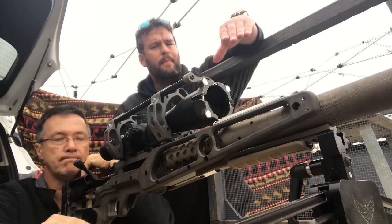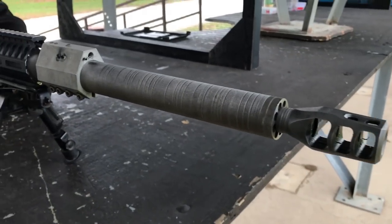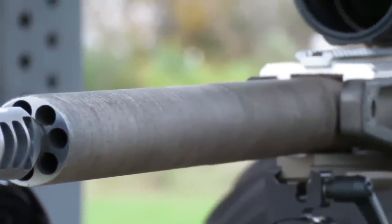You've got opposing forces canceling each other out as the rifle fires. The structuring is not done in the form of a sleeve. Other barrels use different materials like carbon fiber or fill materials to deaden harmonics, but that creates thermodynamic expansion coefficient problems — anytime you make something more complicated and those coefficients change, it makes consistency less uniform. So it's done from a monolithic piece of steel, one barrel blank — not different parts — to reduce those thermodynamic expansion coefficients.